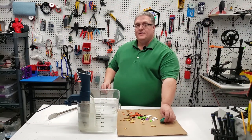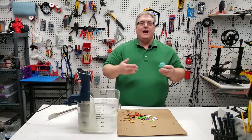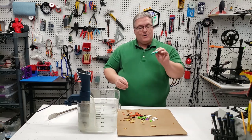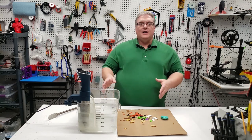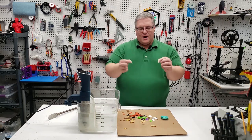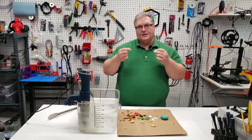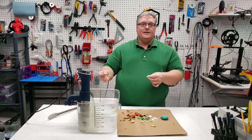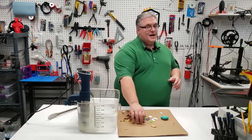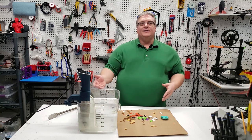Overall, this was a really cool experiment. The concerning thing was that PLA filament with additives to make it silky did not break down the same way, and I questioned whether those additives are biodegradable at all. It was interesting to see how much longer those lasted and how much tougher they were compared to regular PLA. Clearly after seven days there were still whole pieces remaining. So I don't think this fully dissolves, but with minimal force these break right apart — something I certainly couldn't do with fresh PLA. There is some biodegrading or at least degradation taking place when you run PLA at 70°C in regular water. I was really surprised it broke down as quickly as it did — it wasn't four days, but in fairness, it does break apart very easily after just seven days at 70°C.